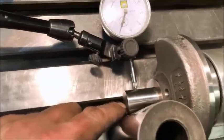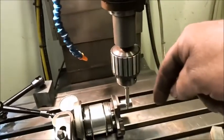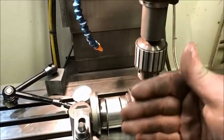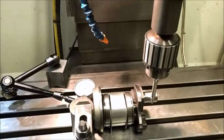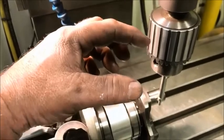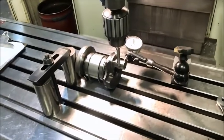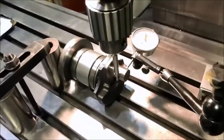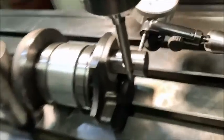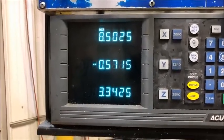Now, how do I find center at the top? Well, this is all dialed in, so all I've got to do is come over and touch off there. It's the same diameter pin and it's only moving up and down and laterally on my X-axis. So I can move this over here now, and I'll just move it over 36 thou. I'll set that to zero. We've got the dial on the other side, and I had to move it 36 thou, which I did. And I went and touched off again at 572 — my target. I'd say that's pretty damn close.